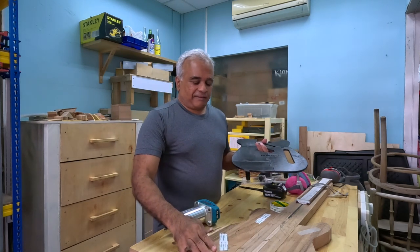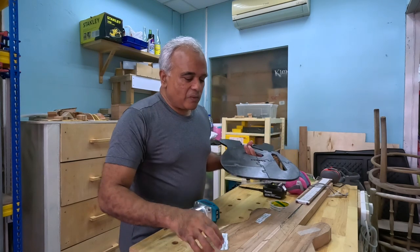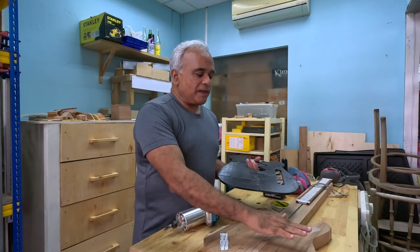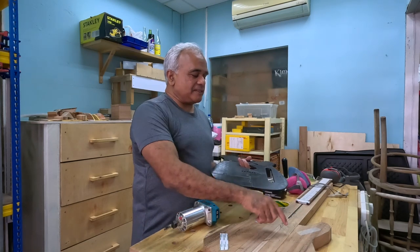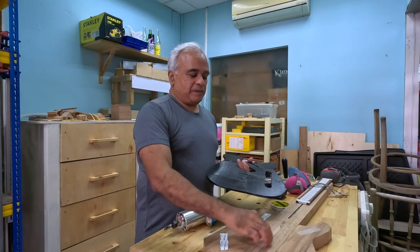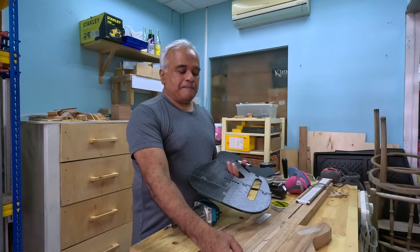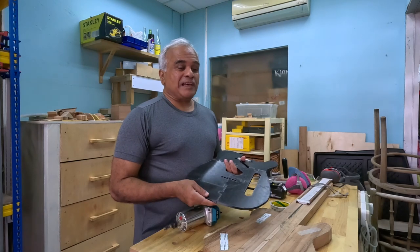So I figure the best way to do this now would be to place these exactly where they should be lined up. Stick the template onto one side, then move it out a little so the other side of the template is supported by the timber, but there is a clearance between the wing that I will route and the piece that runs through the middle, the neck through part, so that I don't accidentally nick anything off this part of the guitar, which I shouldn't be touching right now. Wish me luck!